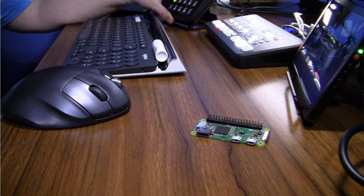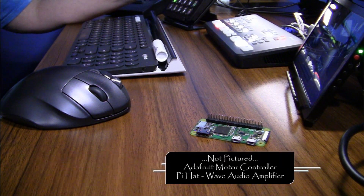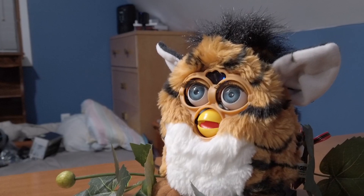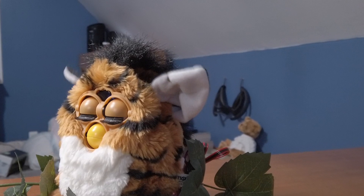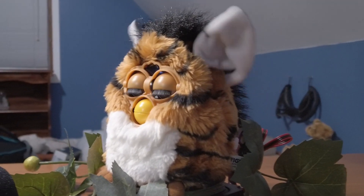With that, I also hooked together an Adafruit motor controller and a Pi-Hat Wave audio amplifier, because the original Furby speaker really was terrible, so I wanted to put a decent speaker system in it. The motor controller in the Furby was old and not very well put together either, so I needed something that would work with a motor system and the Raspberry Pi GPIO pins.